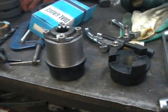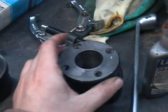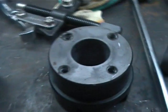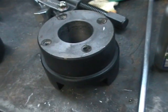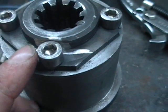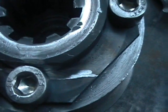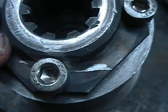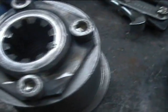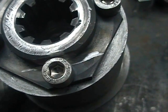So I did a bit of investigation, and it turns out I made a mistake the first time I assembled this — because this had been previously assembled onto the back of the jaw coupler, this half of the jaw coupler. The problem, and this is what probably caused the thing to break up in the first place, was that this cap bolt head here was pushing against the clutch disc, and this was causing it to be off-centre, and thus causing a lot of play. So I've just ground that back down and it seems to fit fine now.